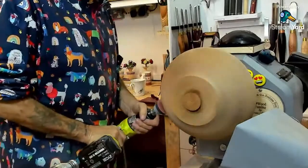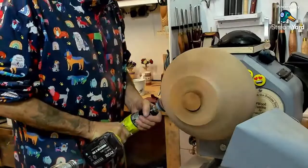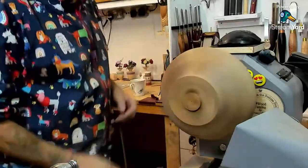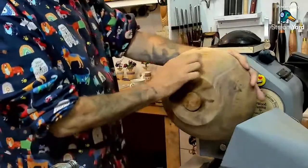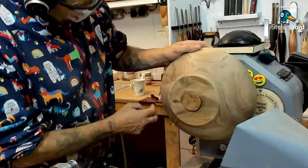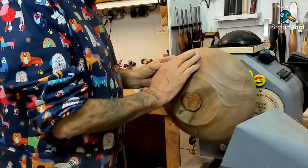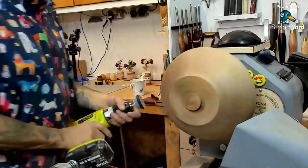So I removed a whole lot of the dust. Just give that a second to flash off and we'll stick a new bit of 240 grit on and see if that does it. Almost looks like a feather in there — absolutely stunning. There's a little dip where the punky bit is. You can see where it's on the hard piece it didn't soak in at all, and it's dry already. But where it's punky it has soaked in a bit. I think that worked a treat, Mark — thanks for that tip. That has made a huge difference. Just a little bit of sanding lines — one more little pass.